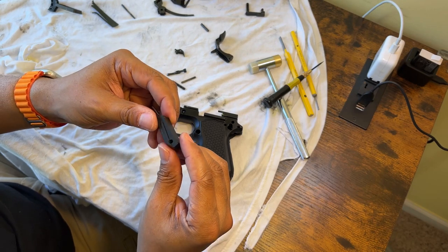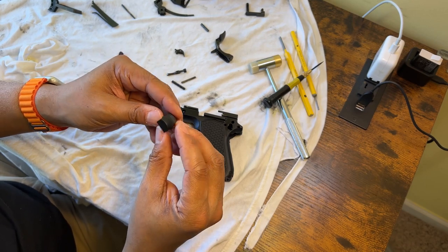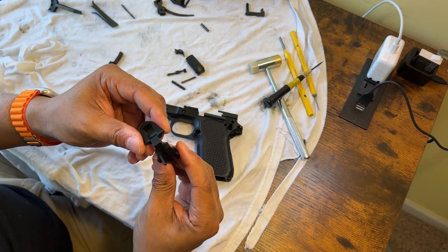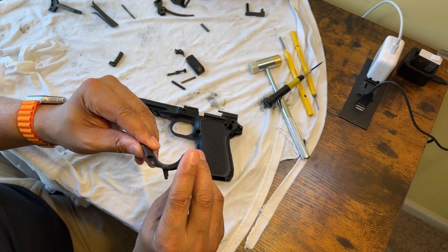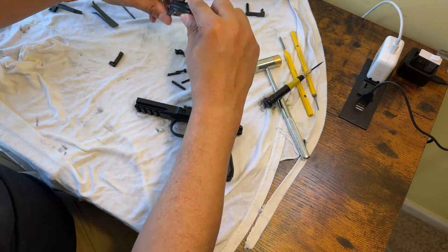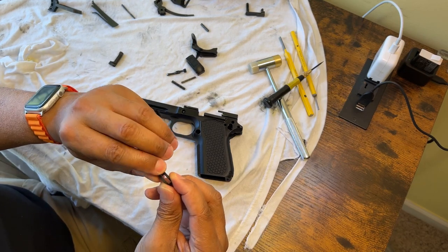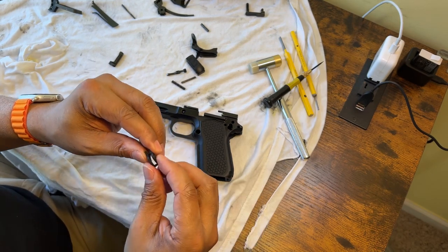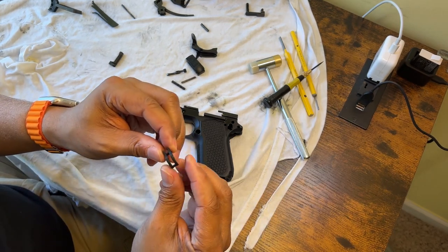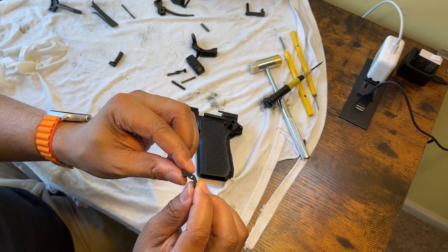The main spring housing — it's not a stress part — I don't see any indication that it's MIM. The beaver tail, I don't believe that's MIM either; I can see machine marks. This part, however — the grip safety area — is MIM, and in addition to that I'm not sure why they painted it, because it's crusty. We cleaned this before; this isn't carbon coming off — it's shedding paint material. They painted this and it's not adhering well; it's slowly flaking off and feels porous.